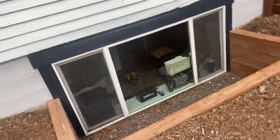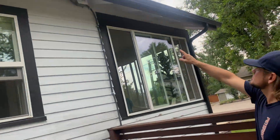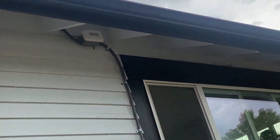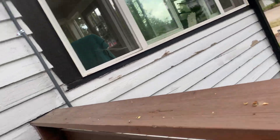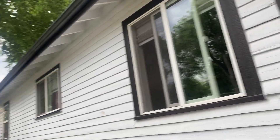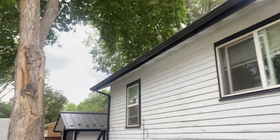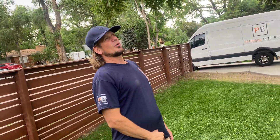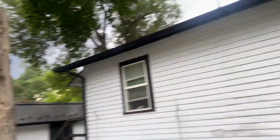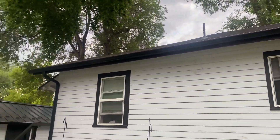All the downstairs is finished, so everything we did was up in the attic — there's a lot of good attic space. We put in a Christmas plug that came down here, a plug in the sunroom, three plugs on the interior, and spliced everything in the attic. If you're splicing in the attic, you've got to be up out of the insulation. We put it up there — it's spaghettied around — but we got just the outlets she needed.